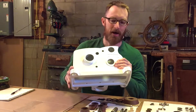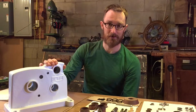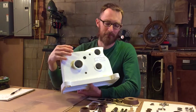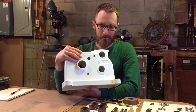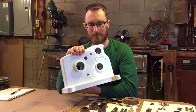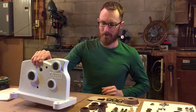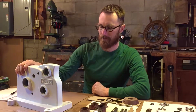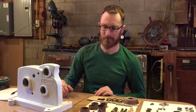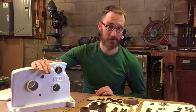Once all the pieces are out, it's time to decide how you want your case to look. Powder coating is usually the way to go, which is what we did here. The process basically applies a charge to the paint powder and an opposite charge to the piece to get a really full, consistent thickness on the piece. And then once the paint is applied, it's baked in an oven, and it's really a resilient coating process. Should last for many years.